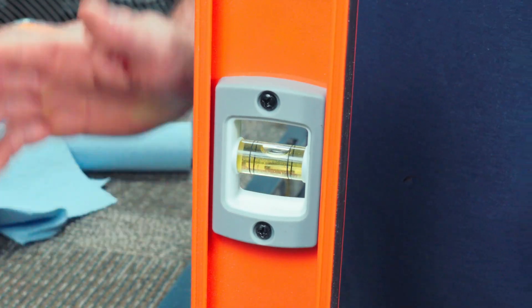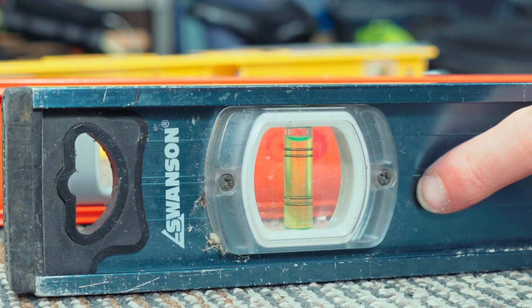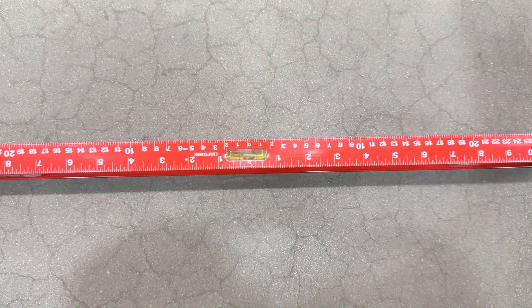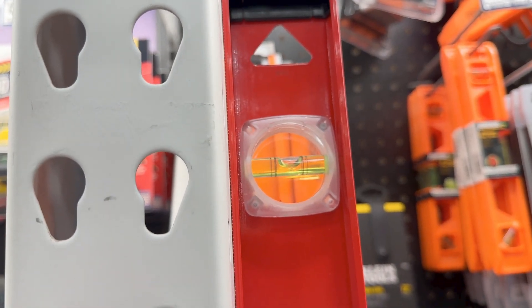You can use these principles I just showed you to adjust these things. My blue long level has the adjustment screws, but a lot of levels these days don't actually adjust. That orange one has screws there, but that doesn't adjust the vials — so keep that in mind. Also, when you're buying a brand new level, don't just assume you're getting a good level because it's brand new. Put it on the floor and test it, flip it the other way, put it on a shelf and check the vertical vials. I've tested several levels at the store and some of them were indeed bad. So I hope this video was helpful — thanks for watching.